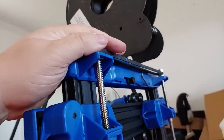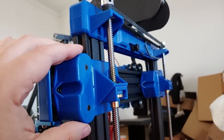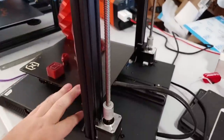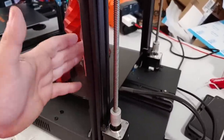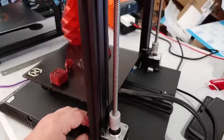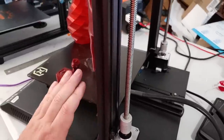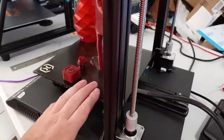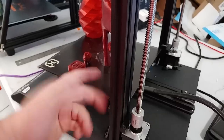All the ABS injection-molded parts fit perfectly — fit and finish is excellent. So far I've had zero problems. It has an AC heat bed with a glass plate, which unfortunately means you can't easily add a flex plate without also carrying the mass of the glass. The biggest issue with the glass plate is if your nozzle is too close, it behaves a little differently than normal beds — if you're getting filament pulling off the bed, you're probably too close, so back the nozzle off a little.